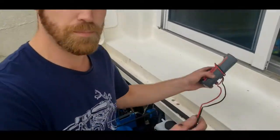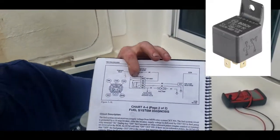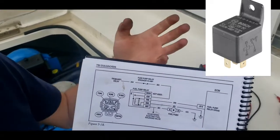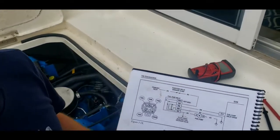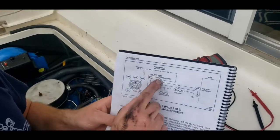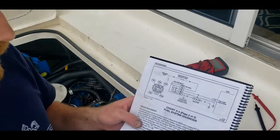What we're going to do is — he's replaced the traditional Bosch relays, as you see here, with a couple of the traditional Ford style relays, because the Bosch relays were burning out on him. The Ford relays have withstood the conditions, so we're going to be testing these relays to see if he's cutting out power.